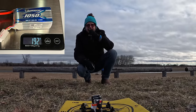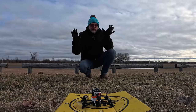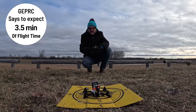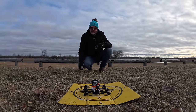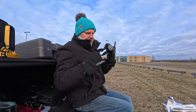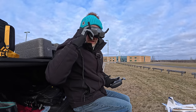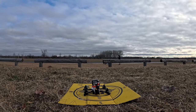I just plugged in a 1050mAh 6S LiPo battery. This can fly with a 1300 or 1500mAh 6S, but the specs online say it only gets about three and a half minutes of flight time since it's a freestyle drone — all the power gets sucked into the ESC and motors. Goggles off — yes, I have a beautiful image. One thing with these FPV goggles: if the power cable comes out while you're flying, your screen goes black. Let's put it in fast flight mode and launch.